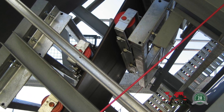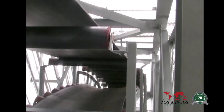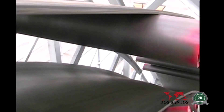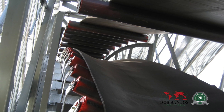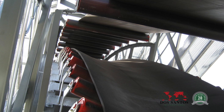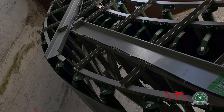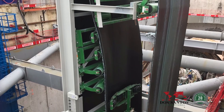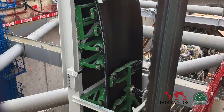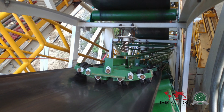In this area, the lower belt changes from a radially hugging belt to a troughing idler-supported belt, while the upper belt goes from an inverted troughed profile to a radially hugging belt. In the case of a snake sandwich conveyor, the path continues as a series of alternating convex curves with inflection zones between the curves. In the case of a GPS or gently pressed sandwich, the lower belt is carried on troughing idlers while pressing mechanisms apply a gentle hugging pressure onto the upper cover belt.